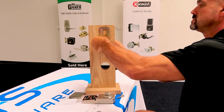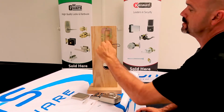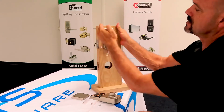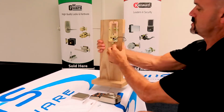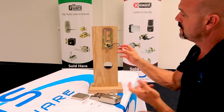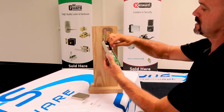Usually with your fingers. With all deadbolt installations, I never tighten up the bolts completely on the door until I make sure it's nice and straight. Arranged perfectly straight, both inside and out. And then we can get going with the installation.